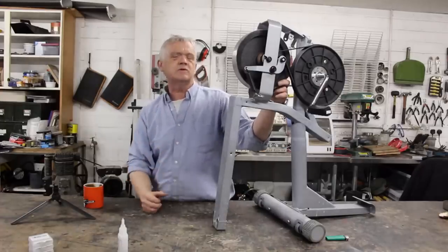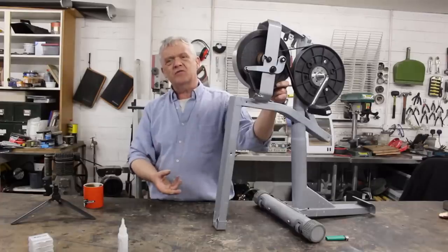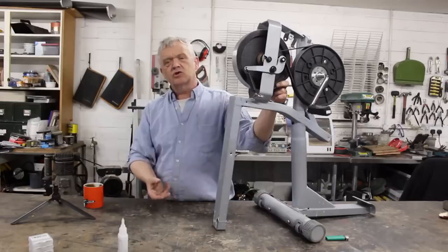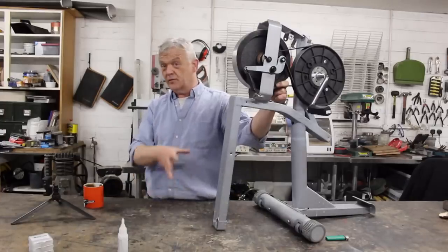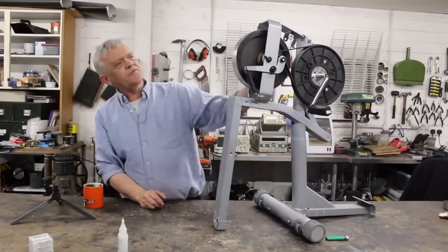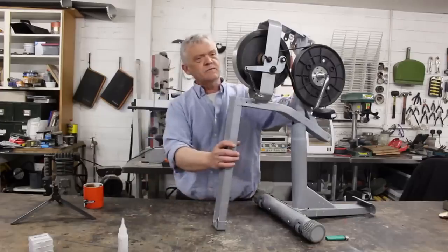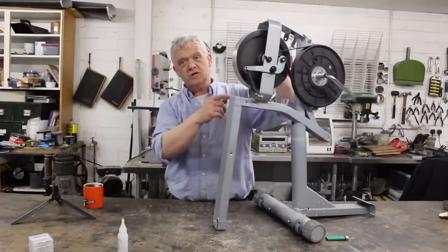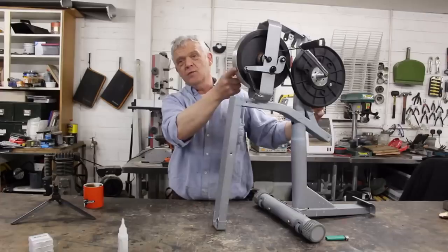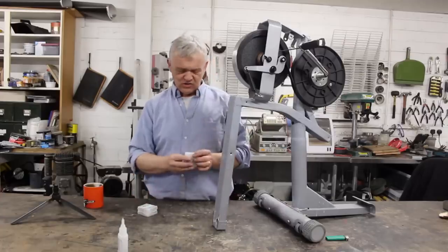In order to do that — and we've done this in previous videos — remember that generation is just about having a magnetic field moving surrounded by coils. Generation depends on three factors: the speed at which the field moves, the strength of the magnetic field, and the number of turns of wire in the coil. We can turn this flywheel into a generator by sticking magnets on the outside. Because of the gearing, even a slow hand speed produces a quick speed at the flywheel, which gives us everything we want.